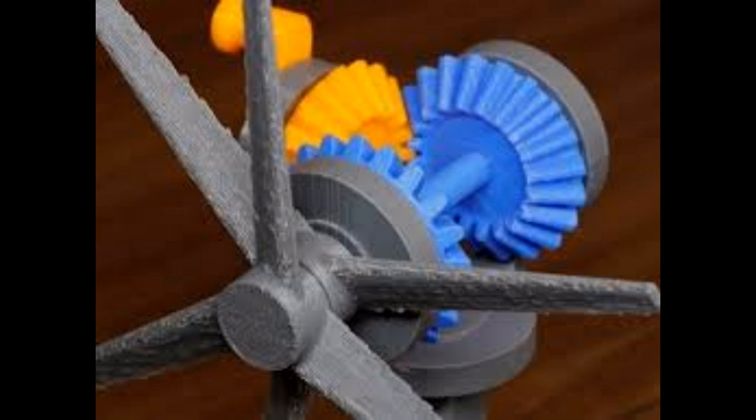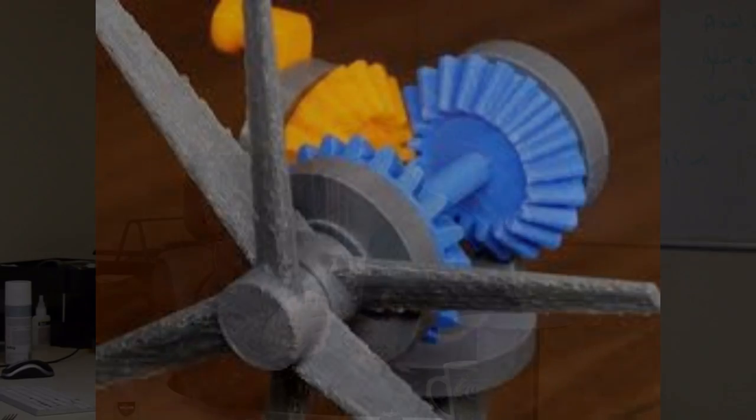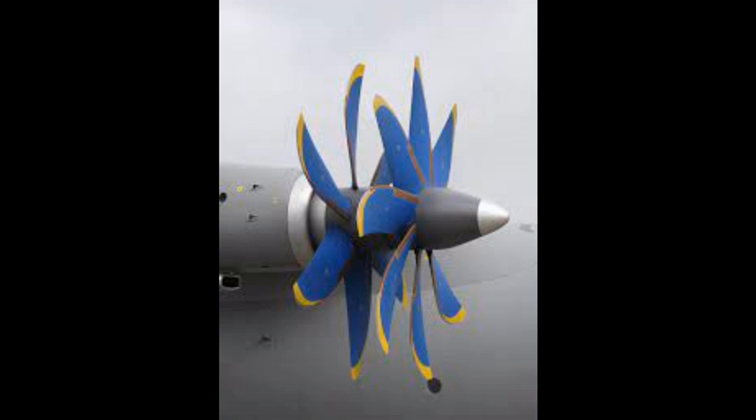What's the use of that? Well, it turns out if you do that, you make it more mechanically complex, because you've got a couple of gearing in there that you need to put in so you can actually get them to do that. But they are better at transmitting the power of a motor, and they're more efficient at their job — somewhere between 6 and 16% more efficient. And that's why you find them on aeroplanes, and that's where they've lived: aeroplanes and torpedoes mostly.